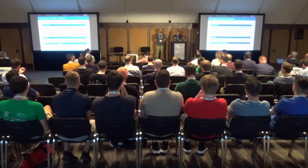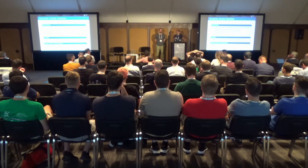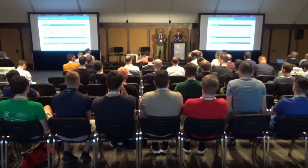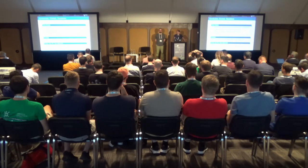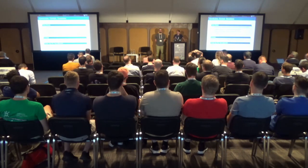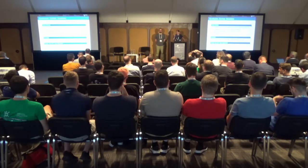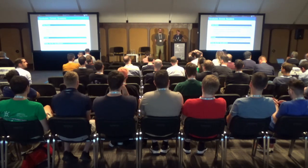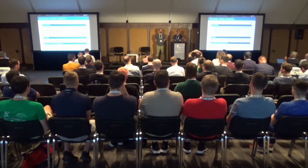With one shield box, it might be enough, but what you have to keep in mind is that we don't just want the case where the stronger signal wins. We also have features like listen before talk, where the transceiver checks whether there is any signal on air, and if there is, it will not send. So even if it's just a really weak signal, it might decide not to send, and it's not the case where the stronger signal wins. So for that, it helps. It might be a bit overkill, but we suffered enough to want to do that.